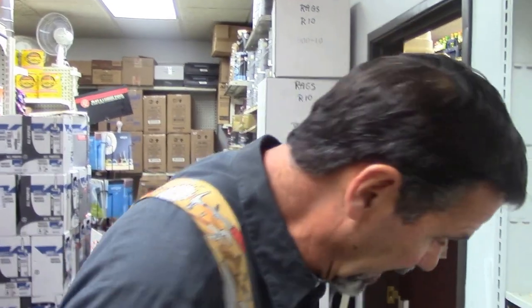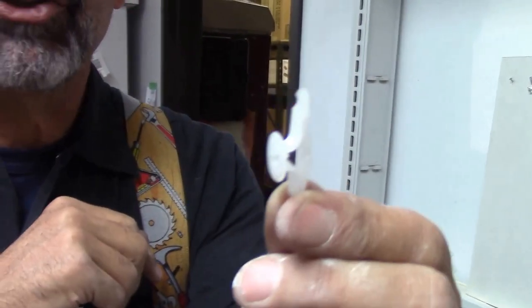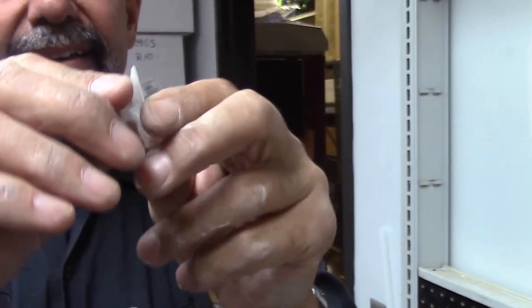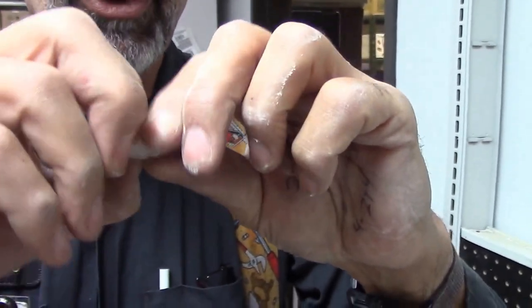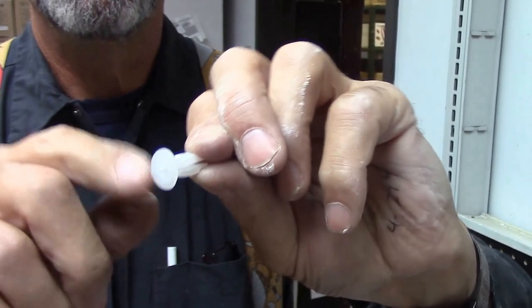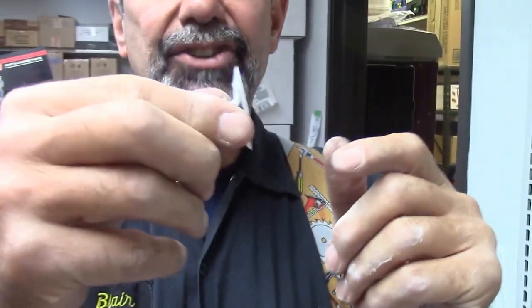Now, one anchor that I see in a lot of kits, this particular one should have a half inch gap in here for half inch drywall. And I just am not fond of them because I never know how they're performing for me. I drill a hole, kind of a large hole, bigger than my quarter inch holes, and I shove it in, and then I have to hope my screw pushes these fingers out to make this strong.